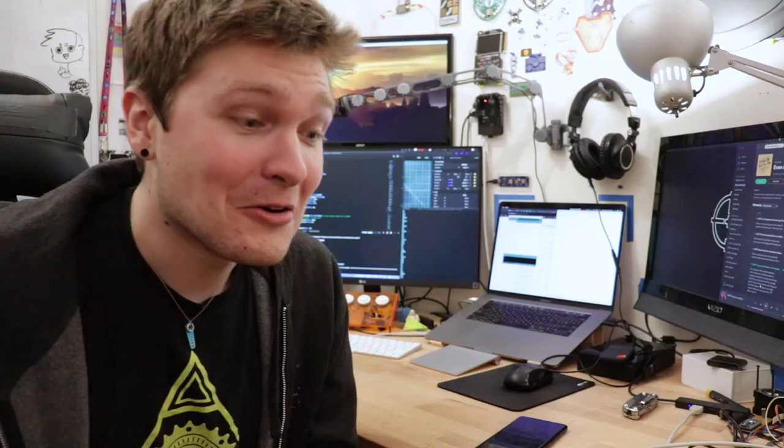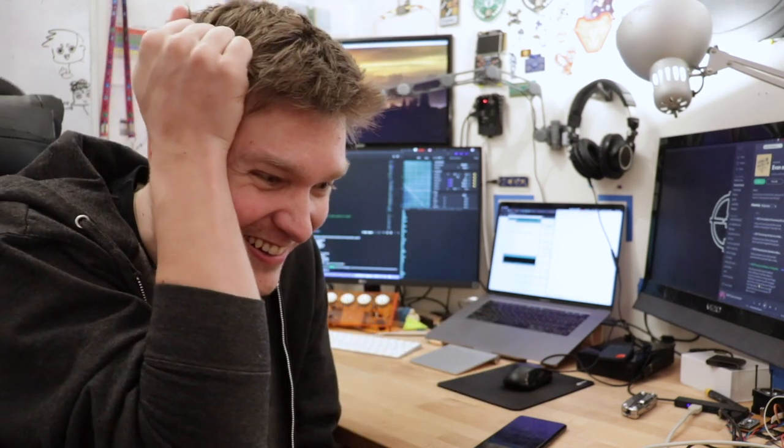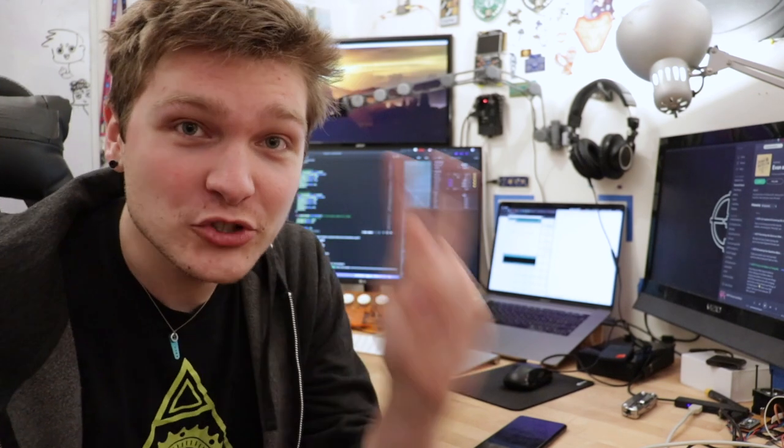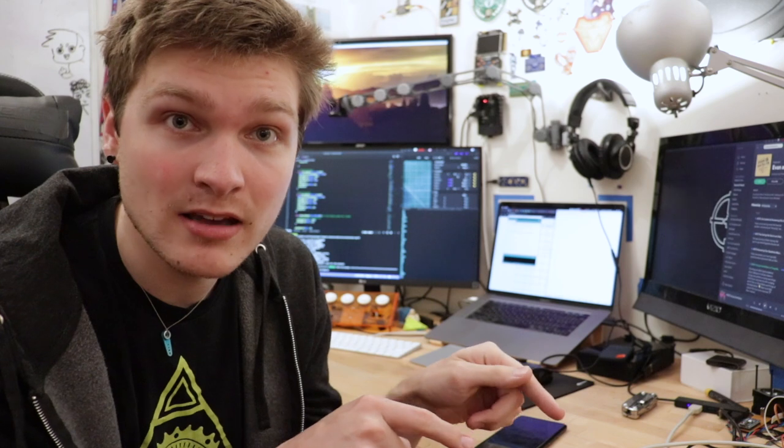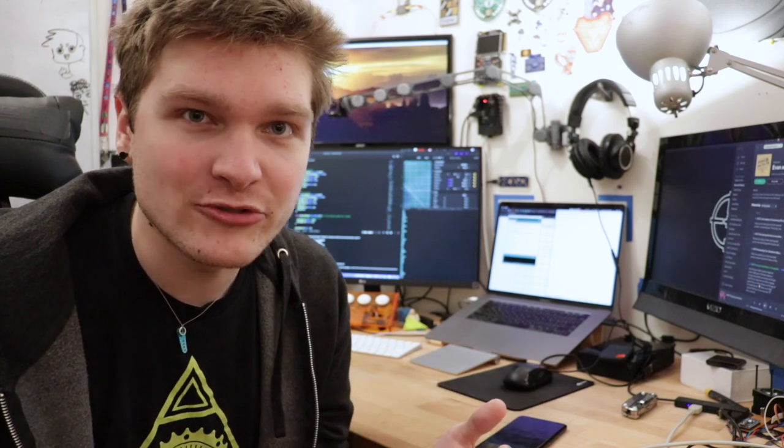Okay, so the feeder ID totally works. The feeder knows exactly what slot it's in based on the voltage divider, and it can use that information to know which commands over RS-485 it should listen to. So right now I only have two feeder slots set up on the bus down here. There's a difference of about 0.1 volts, which would break up the 3.3 volts that I have of range on my ADC on the feeder chip to be about 32 different divisions.